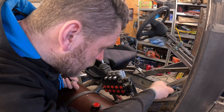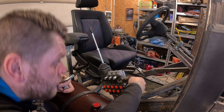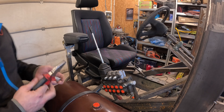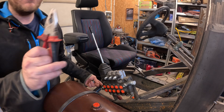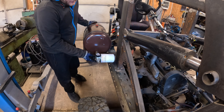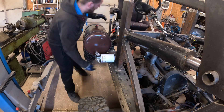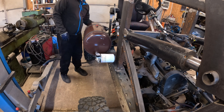Adapters. This is the pump side — this has to go directly to the pump. And this is the tank side; this is going to the filter. It would look really good when I use the 90-degree adapters to go down here, and up here to the tank port.